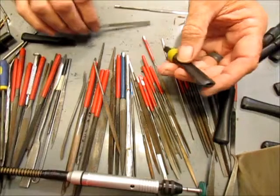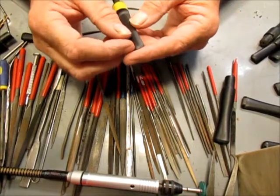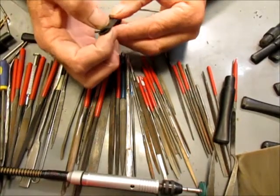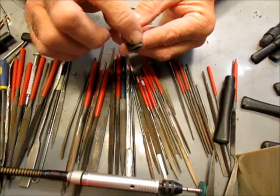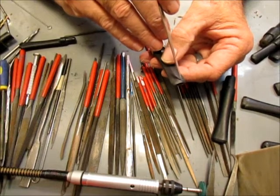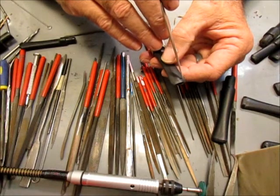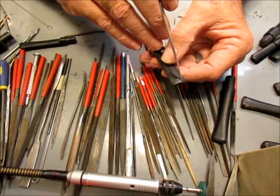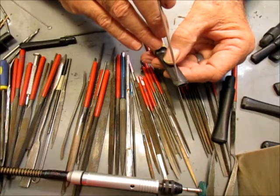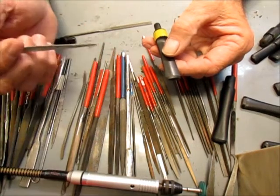Now, if you were trying to do a similar thing with sandpaper, if you were to fold your sandpaper over and carefully try and get in there, or even cut a very close bit of sandpaper, it's difficult to get in there and really get right to this mid part right in here, and you end up with a little crescent of area that either is not sanded smooth, or has undercuts in it, or is hazy looking. Also, when you buff, your buffing lines in this direction can pick up and emphasize any scratches that you've left in that process.